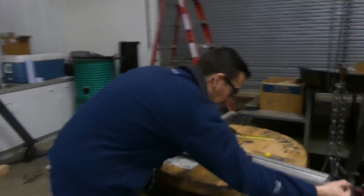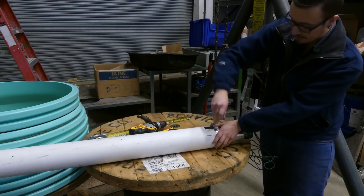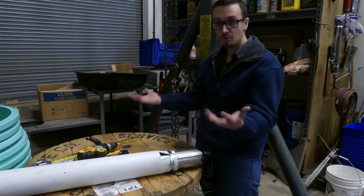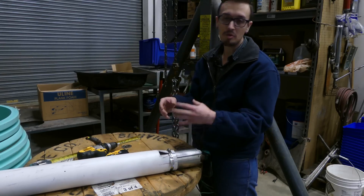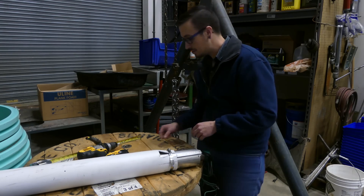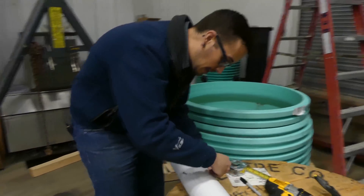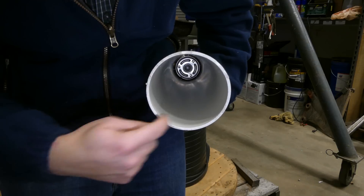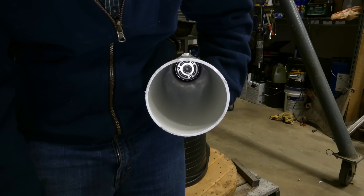Now we'll insert the pump and motor the rest of the way up to our line. You might notice there are some gaps here — that's perfectly normal. What we're creating is a path of least resistance for the water to come up through the bottom. It doesn't need to be a perfect seal because we're still going to have the majority of the water coming from the bottom, thus accomplishing the improved cooling. Let's get these screws set. You should be able to see that the motor is now not resting on any particular wall inside here.